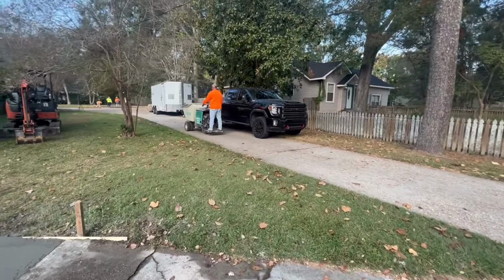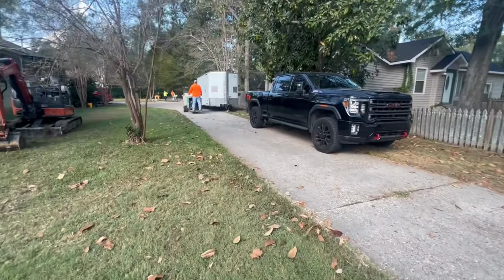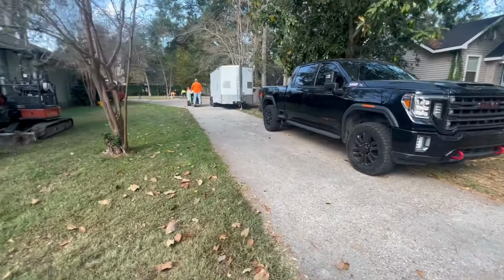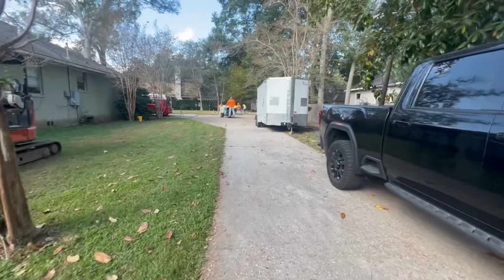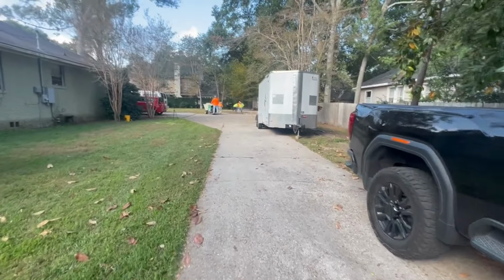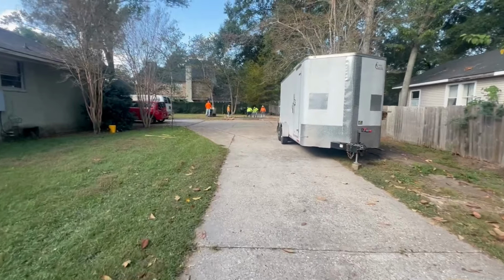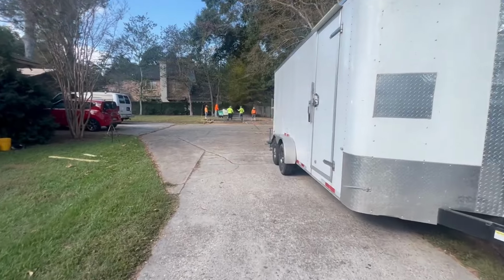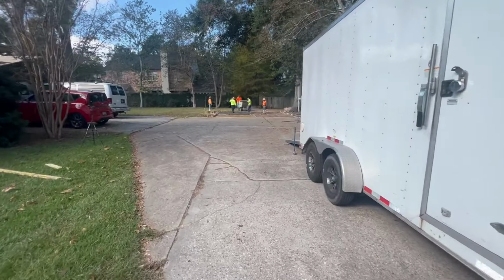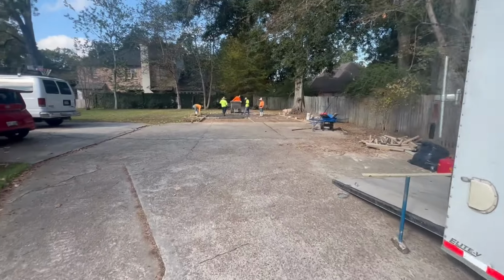21 cubic feet. There's 27 cubic feet in a yard, 3 times 3 times 3, and a yard weighs 4,100 pounds roughly. So that little machine has over 3,000 pounds of concrete in it, that's my guess. It just glides along. Luckily, it hadn't rained here forever, so the grass and the ground is hard as a rock. Not leaving any ruts at all.